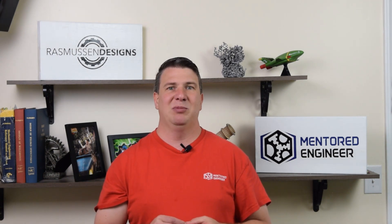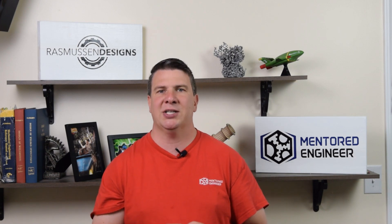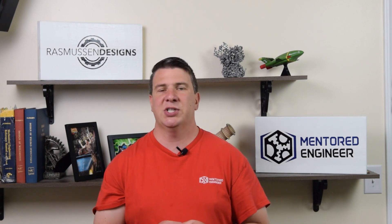When you look at capacitors you can generally find them with small capacitances and large voltages, or large capacitances and small voltages. We need both, so we're going to have to add a bunch of these together. Looking online, 2.7 volts is a common capacitor voltage for large capacitors. If we divide our 96 volts by 2.7 volts, we need 36 capacitors all strung together in series.